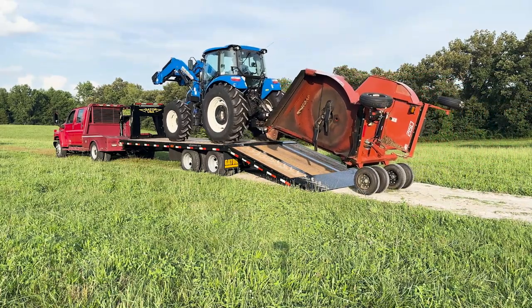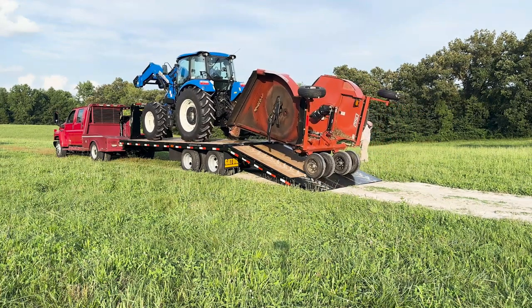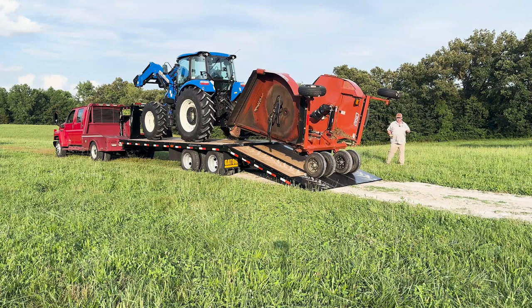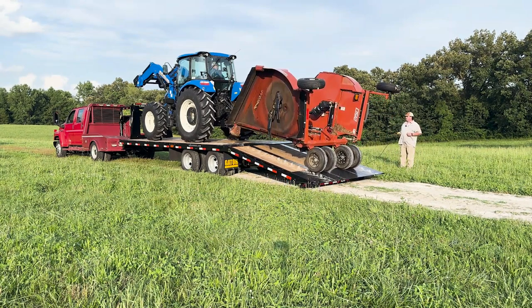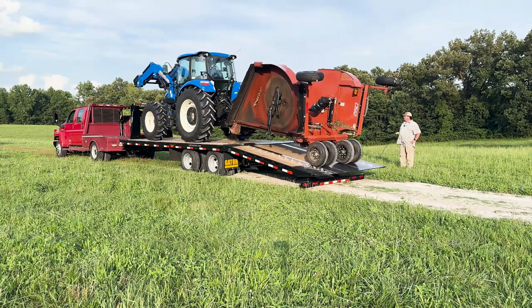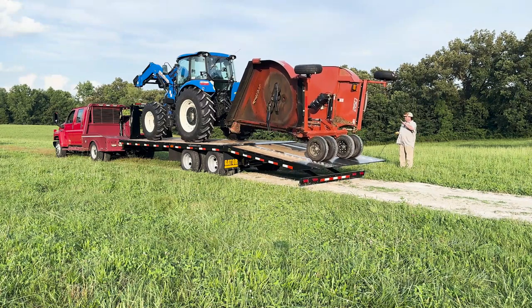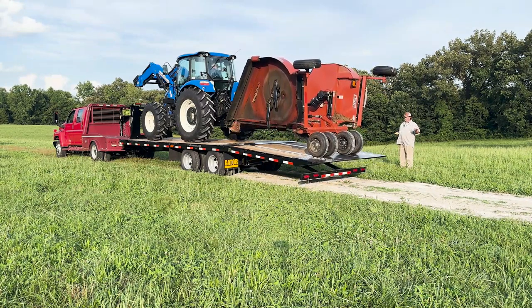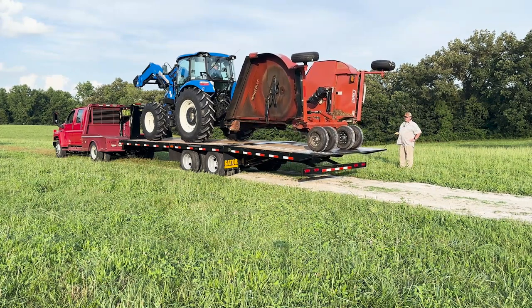You'll see a little bit of squat on the big red up there. With a wide ramp trailer this would have been a lot more difficult — you'd have to have a lot longer trailer to do everything and fit level. This right here has no issue picking that up. From tip to tail with the bucket on, this load is over 30 foot, but with the way he's positioned his bucket and the use of a hydraulic dovetail, we're going to have no issue getting this whole load on here with the correct weight placement on the truck.